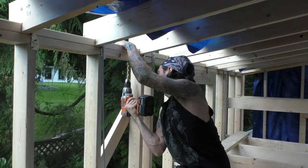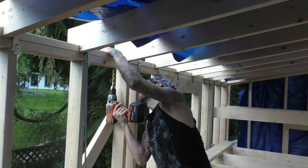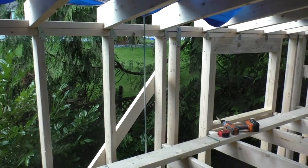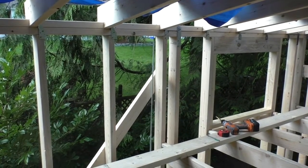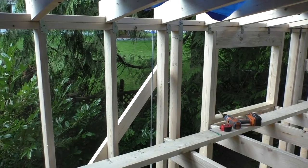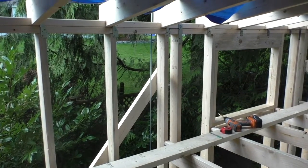To ensure there was an unbroken connection from the top of the house to the trailer, we installed threaded metal rods. The rods are three-eighths inch in diameter and there are six of them around the house — three on each of the long walls. We needed to go to a store that specializes in fasteners to find these.